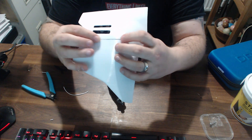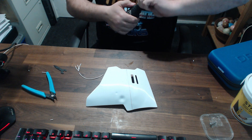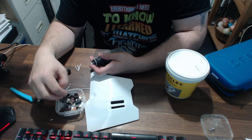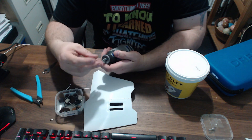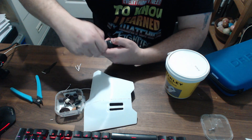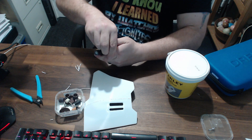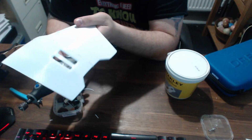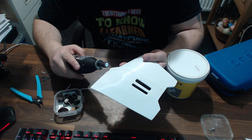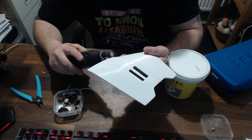We've got the joint done — I've done both sides, and you can see there's a quite nasty weld line on the front of the armor which we don't want. So I'm going to switch out to a sanding tool just to take down the bulk of the plastic. These are quite good because they heat the plastic due to the speed they go at, and that helps melt it and clean it up, giving a nice smooth finish. I'm very lightly going over it, melting away that weld line.